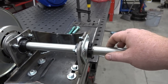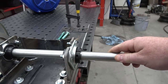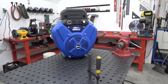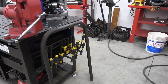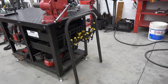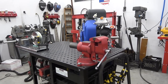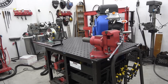What I'm going to do is machine up two 14-tooth sprockets and TIG weld them together on one wide hub with a big key, then do double sprockets on our axle as well. That'll allow the power this engine is going to make to safely get to the axle. I have this one-and-a-half-inch piece of tube that's been bent — it was for a random project and it was a mess up — but I think we can use that to make our base setup for the whole swing arm. I'm going to get it clamped up on the table, set the engine in, make sure we get everything positioned right, do the right rise to our engine plate for chain clearance, and then start building this thing up.